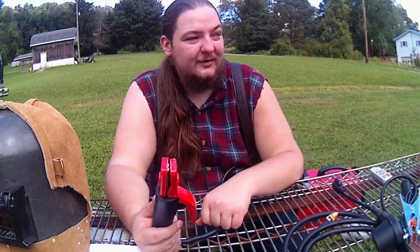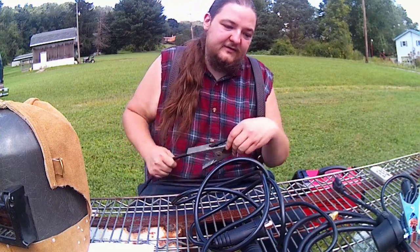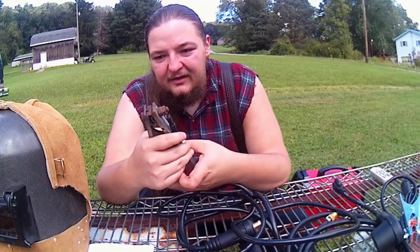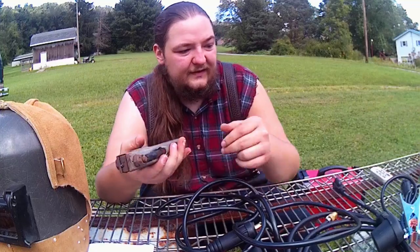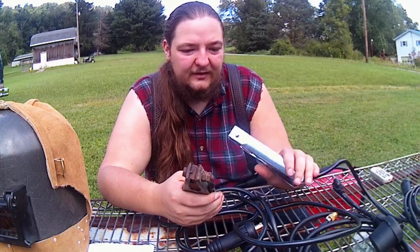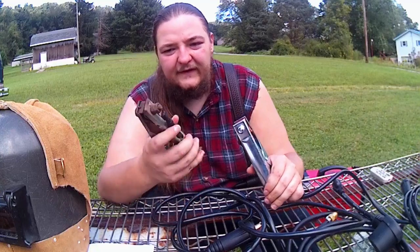I can actually go grab that and compare it here. Vulcan leads here. Not for the MIG, but at least just the stick and the ground clamp. So the Vulcans do have a heavier gauge wire, which is good. So that part I'm probably going to end up keeping. The ground clamp's alright. It does have the copper wiring and stuff like this. The spring is a little bit more robust, so I might have been a little bit wrong right off the gate. But I do like how this has the two little points in this one. That way it helps get a couple more points of contact.